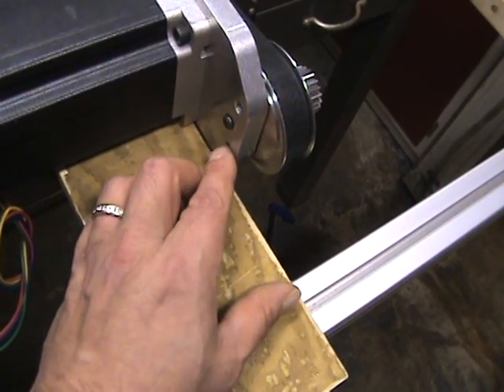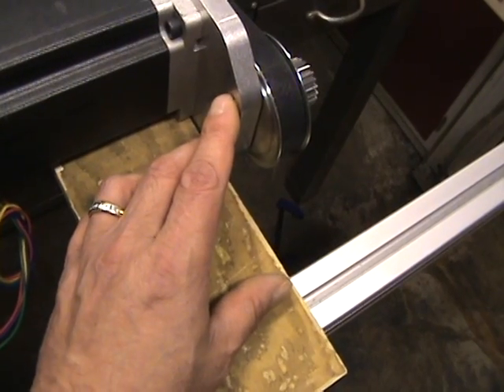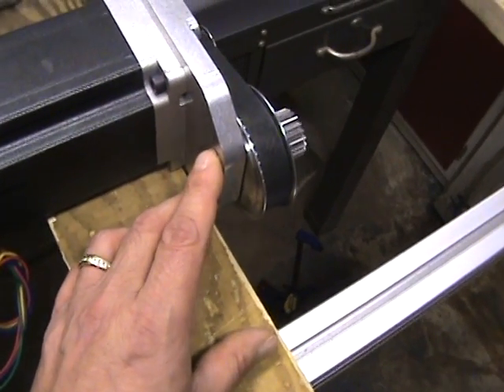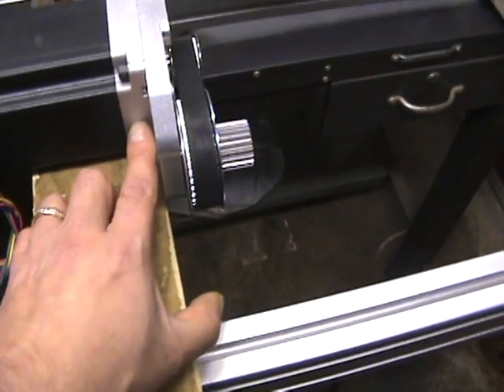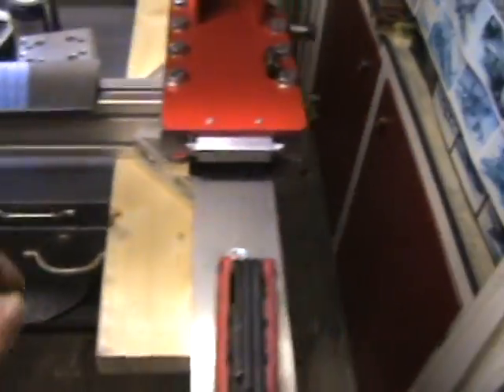The belt tensioning needs a little more work. I may make some brackets after I get everything assembled. There are two bolt holes originally designed for the original system that used two bolts, an adjustment mechanism, and a spring. I may make a bracket that mounts here with another bolt so you can push on the motor to make tensioning easier.